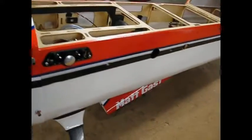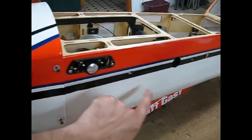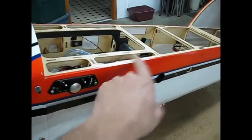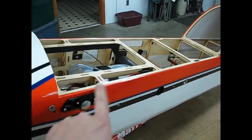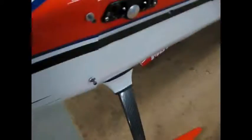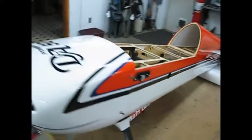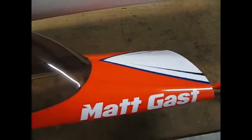This covering — for anybody that's interested in this new style covering, this printed one-piece covering — interesting stuff. Very thick. If you're going to do any edges with your sealing iron, you've got to have your iron turned all the way up. That little sock, the white sock that goes on there, it sticks. I found a paper towel works better — just put the paper towel over the covering when you want a seam seal and hit it with an iron turned way up. You can tell it's printed when you get down on top of it — you see the little imperfections where it didn't fill in all the way, and it even bleeds a little bit. But it chips — in the areas where it's tightly curved and something bumps it, it chips like paint. It's the craziest thing I've ever seen. But I think it's going to be pretty good in the long run. It's gorgeous out in the sunlight. This orange paint has pearl flakes in it — absolutely gorgeous in the sunlight.